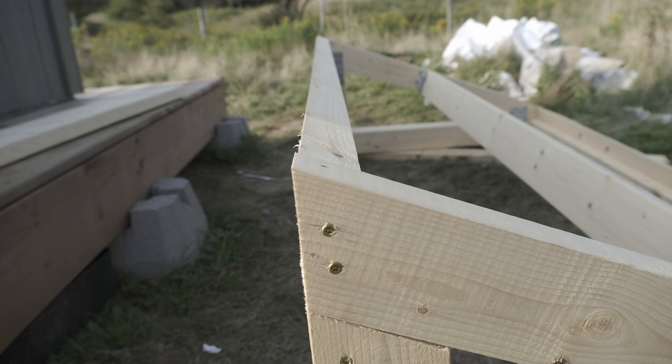All the beams have to be thoroughly fastened and locked rock solid together with metal bracing. And when the plywood is added, we'll get a lot more lateral strength. When that's all done, I'll add a liquid rubber roof, mount the two roof parts into place, add a cap over the east roof, install internal rails to keep them aligned when they're slid in and out, and a kind of landing pad for the roof halves to sit on when they're pulled out and the observatory is used during the night. It's mostly done, with a lot of detail yet to cover. We'll get to that soon. Thanks for watching.